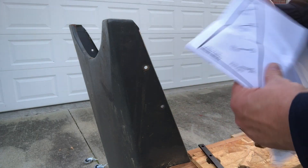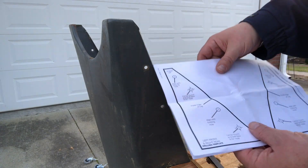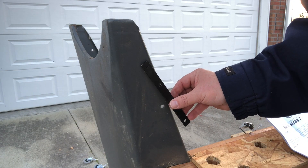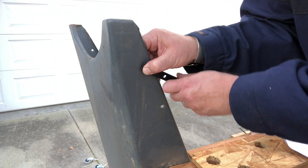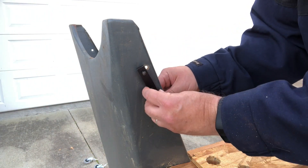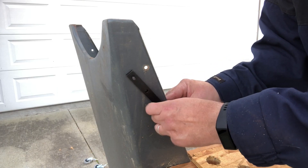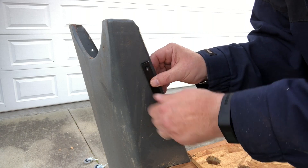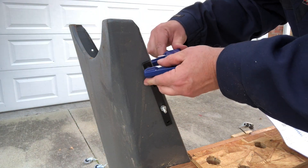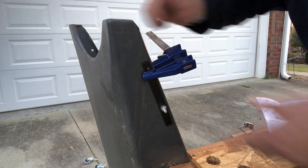The premium caster set does come with some full-size templates that can be used for marking the location of the new holes that you're going to have to drill. You can tape this template in place. There's also a drill jig available that indexes into one of the pre-existing holes. The problem is the pin on that jig didn't fit any of my pre-existing holes. I could have enlarged that hole by running a drill bit into it, but I thought, this is nuts — I should be able to do this. What I wound up doing is using the hole that's designed to bolt in place through one of the original holes in the legs, and instead of having the pin pass through that other hole, I have the pin pointing away from the hole and, from the back side, align it centered with the hole and clamp it in place. That worked just fine, but it does seem like there would have been a little more precision built into this kit.